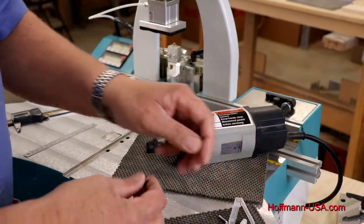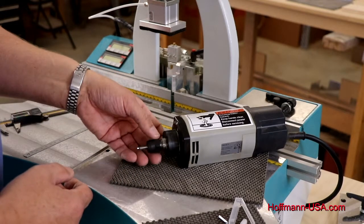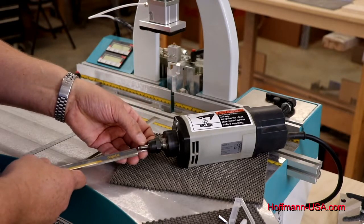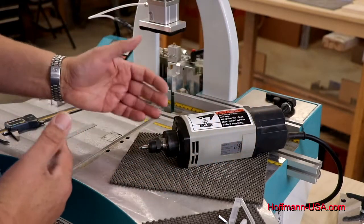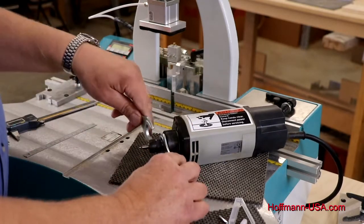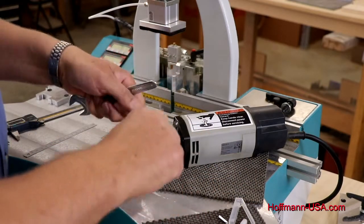This is a W1 bit and I'll put that back in here. The approximate settings or projections for the different bits are listed in your manual. There's not a whole lot of difference from W1 to W2 or W2 to W3, so you can pretty much use the same setting — this is just to get you in the ballpark, not too far in or too far out. The actual fine adjustment will be done later with the fine adjustment on the machine. 18 millimeter wrench on the spindle, 22 millimeter wrench on the collet nut, and hand tight. You don't need to bear down on it or put pipe extensions on your wrenches — just hand tight.